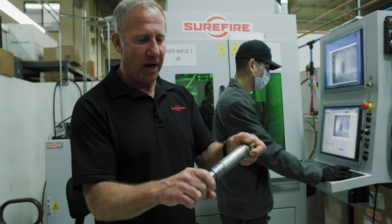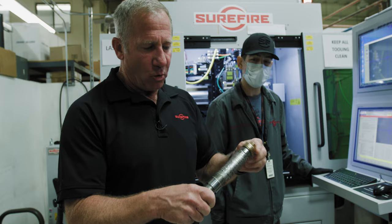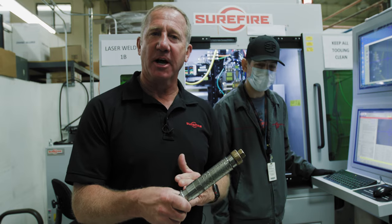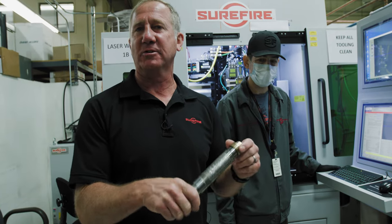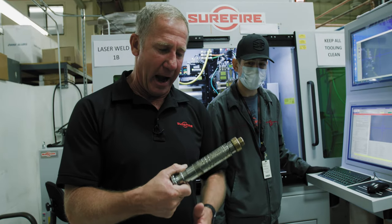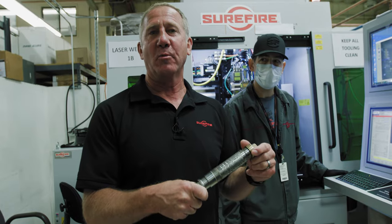Parts start out fixtured up in a line, then go into the welder. You can watch the thing working — we have precision laser welds. When I first looked at these and started exploring the technology, I thought, how can this weld be strong? We did a series of pull tests and lab experiments and it turned out we were double the strength of manual welds. The part isn't all heat saturated, which helps keep the parts straight for the manufacturing process, and the welds are sequenced in order to avoid warping — overall just a much more advanced process.